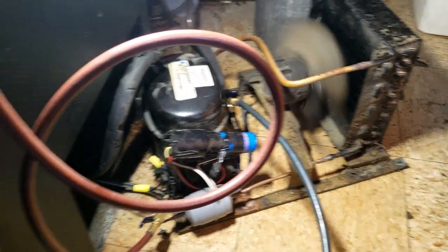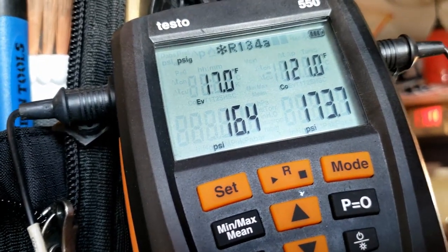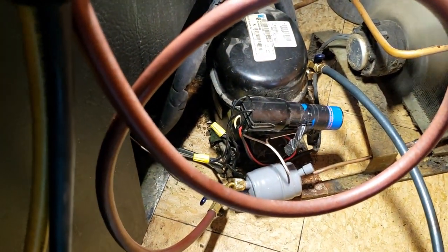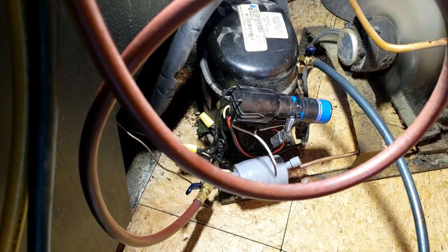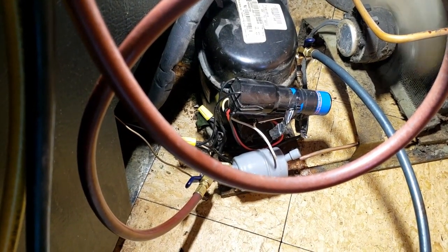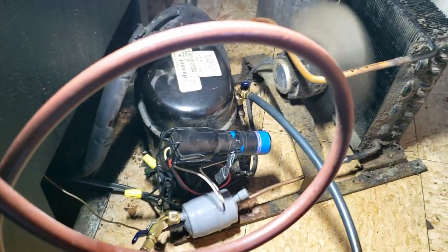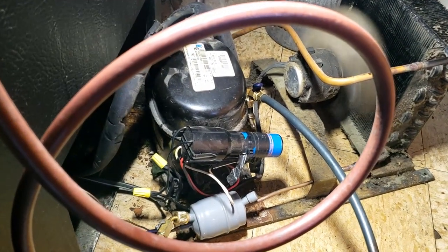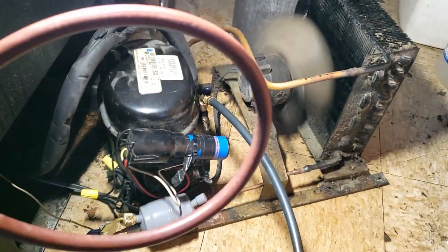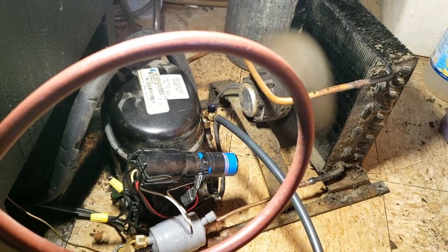It's looking pretty good, believe it or not. We've got a 21-degree coil and 17-degree evaporator. When I disconnect I'm not going to be dumping the high side, and the low side has basically added about an extra ounce for my hose. So far looking good. We'll go ahead and get that filter dryer buttoned up, put it back together, and tell them there's potentially some damage done but it's working now. It's pretty warm in here and the box is warm, so as soon as temperatures start dropping the pressures will drop too and everything will look great. That's going to wrap this one up.